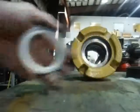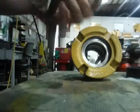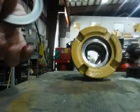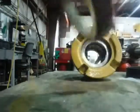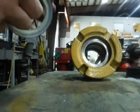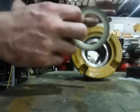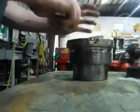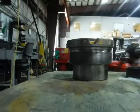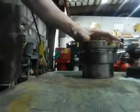It's a metal clad wiper. Put a little Loctite on there — lock it up tight. I would not advise beating it around in here and beating it in. The reason is you'll shoot the Loctite down inside the seal grooves, and if you don't get all that Loctite out and it decides to set up, it'd be pretty bad. Now this part is not the easiest thing to do. Some of the kits actually come with the tool, but you're going to kind of hit down and back at an angle.